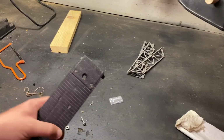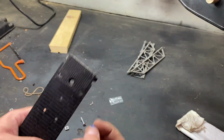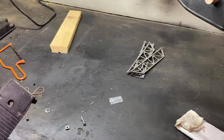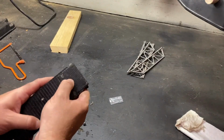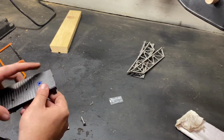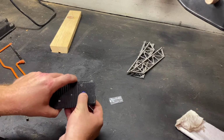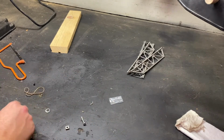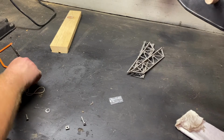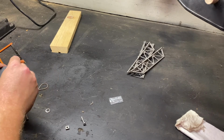Stay tuned. Okay, guys, after discovering something off camera, I noticed that I melted the plastic in this hole. I figured out a way I can fix this that will possibly work: take a plastic wall anchor, just cut the end off where you enter the screw, enlarge the hole, press it in, then put your parts right back in, and you're in business. Because I knew it was wide enough to fill in that hole.